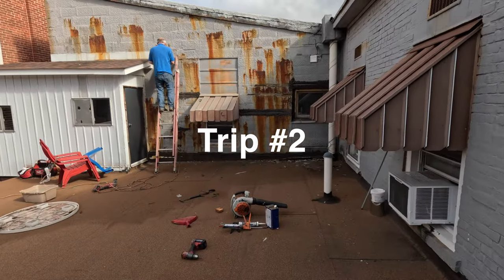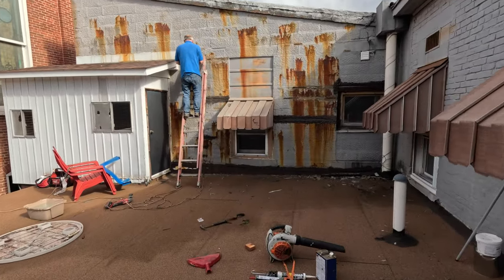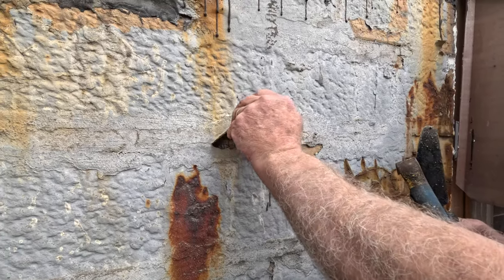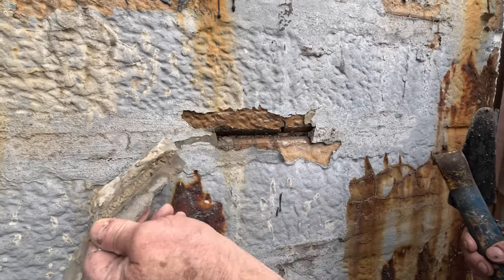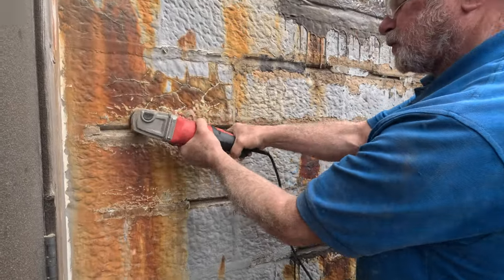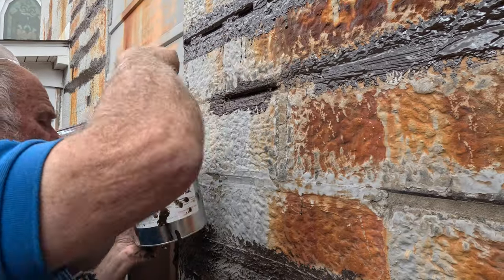My wife and I went back and thought, it's the wall. All the cracks and the grouting in the wall had come out — it was leaking from the wall. So we started by grinding all the paint off and sealing all the grouting lines on the wall.